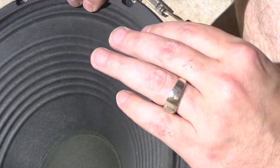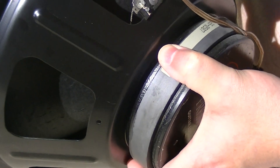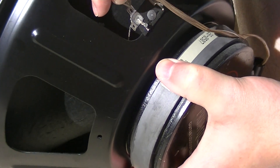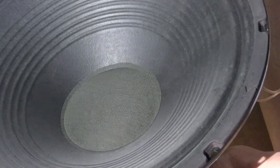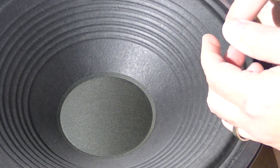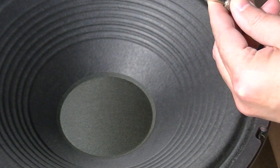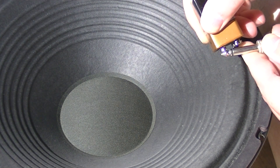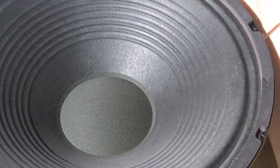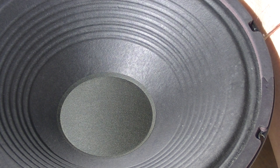So if I go back here and switch these wires around the way they're supposed to be — put this one over here — positive to positive, and here comes the negative going to the ground. This sucker should push out. There you go! If you can't see it clearly, you can put a few pieces of something in there — BBs, glitter, or talcum powder — and that will make it easy to see.